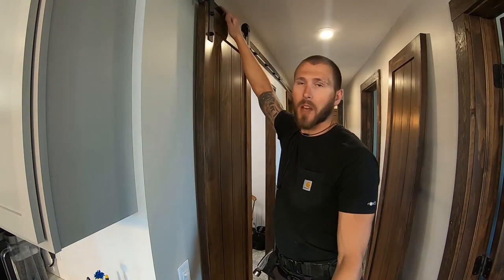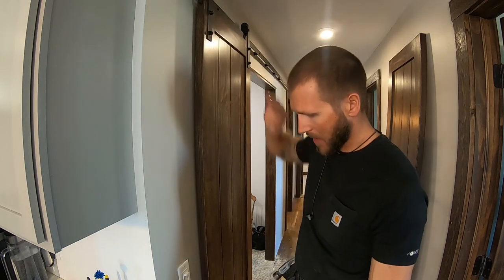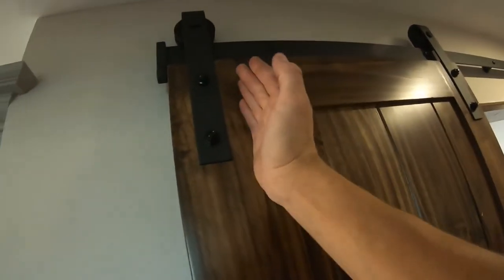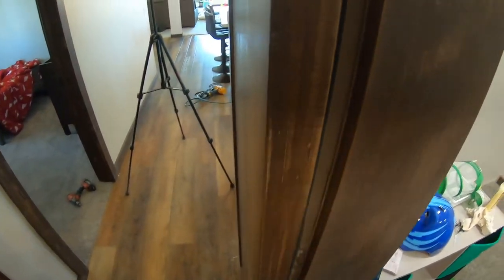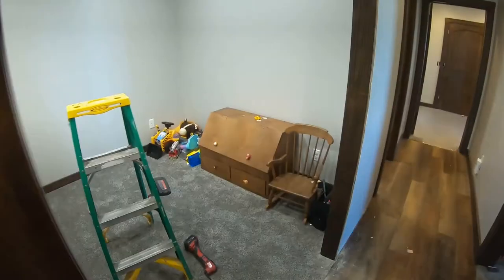I wanted to get a door up before continuing my layout to verify the stop placement and make sure I didn't need to bring my rail further over. These are the door stops that catch the door. I decided to center the rollers in the center of the stiles, and calculated that would give me the reveal I need — you can see the door clears all the way. I also checked the thickness of my casing — with the baseboard, the casing clears fine. The door stop placement was my main area of contention.